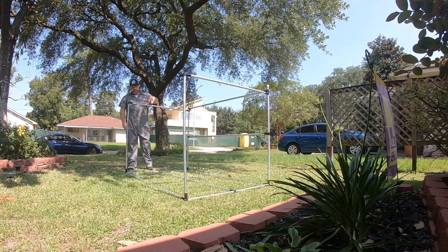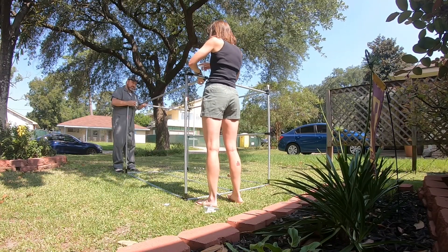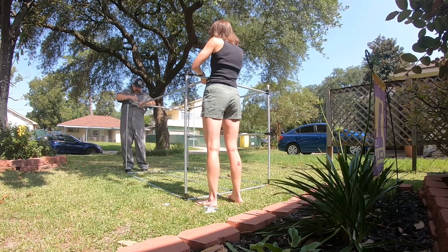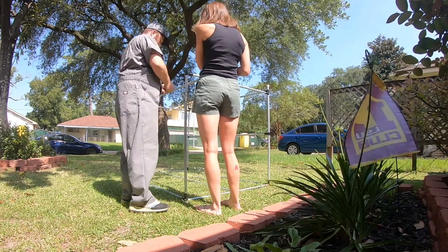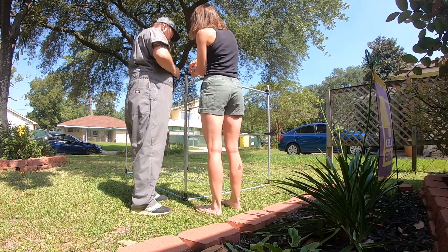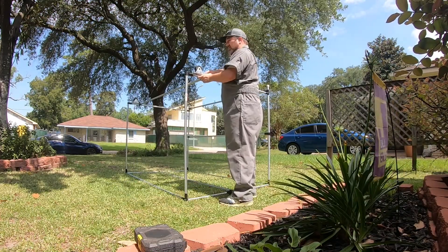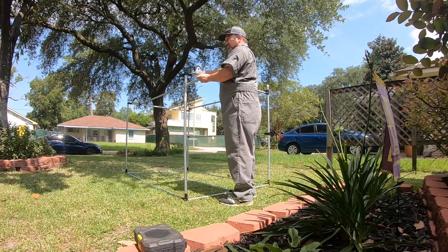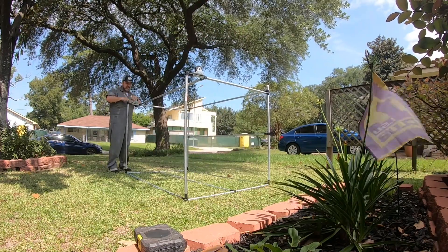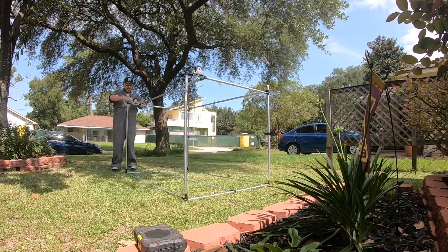For this rack I need to be able to roll it to the Jeep, take the top off, and then roll and position it into the garage. To make this happen, we added three-inch casters from the box store to the front side bottom of the rack, connected with U-bolts that went over the three-quarter-inch pipe. On the opposite end, we extended the feet down to compensate for the height of the wheels, then added three-quarter-inch rubber feet on the ends of those pipes for a nice secure base — so when I rolled this into my garage, I could be certain it would stay in place and not risk falling and hitting my car.